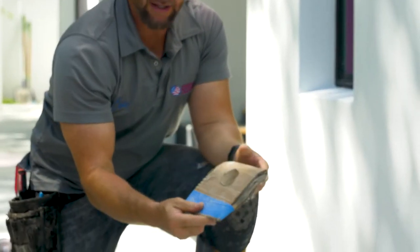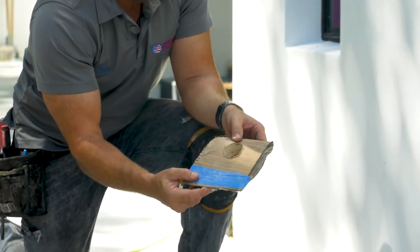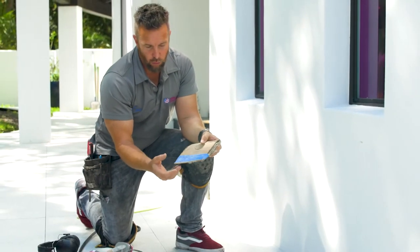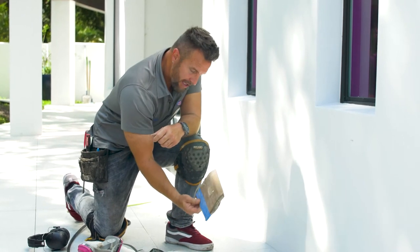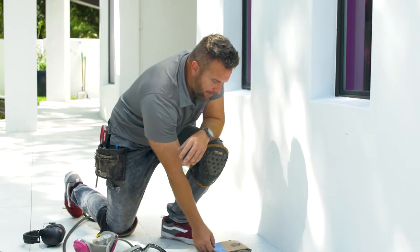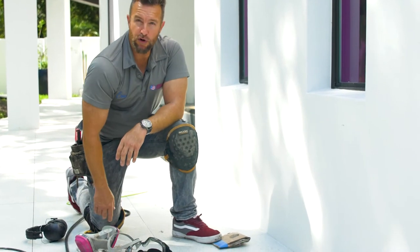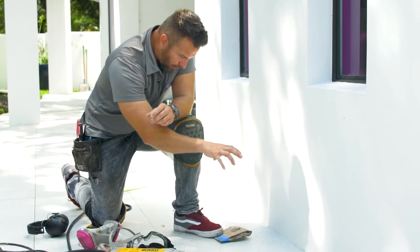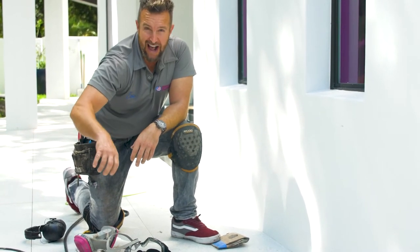A template is crucial. You can make a template for a small bit or the large bit using cardboard — just fold it up and tape it off. I found wood makes the bit bind a little more, so I use something lighter and easier to pick up. Once you make your template you drill it into the dirt, line it up exactly where you're supposed to be. Put your foot on it so it doesn't move around before drilling, then when drilling you're wallering — making clockwise circular motions — to allow the core to be smaller than the bit itself so when you clean it out it's a lot easier.